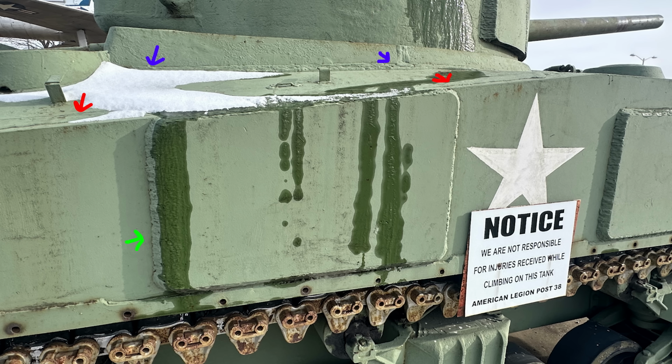Now, the plate there with the green arrow, the green is for gangster green, as in gangster welds. And what I mean by that is it looks like it's a big giant weave pass, but what that actually is, is stacked horizontal stringer welds. And you're probably wondering why on earth would they ever do that? Because in modern times you don't do stuff like that. You just run vertical up stringers per se. And the reason is simple.